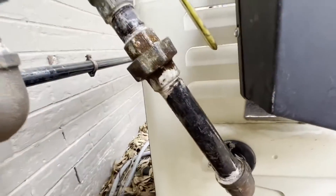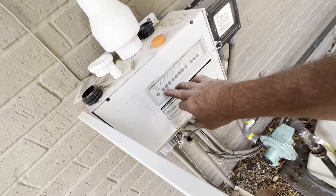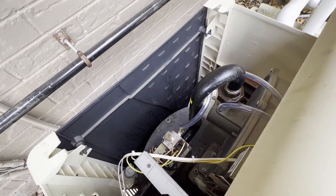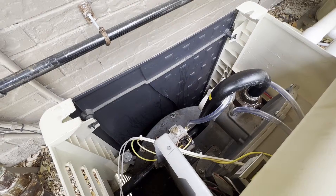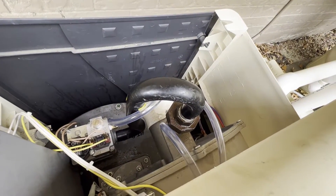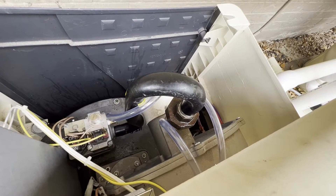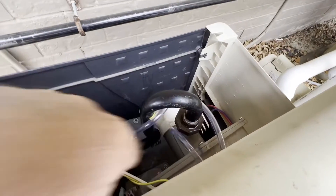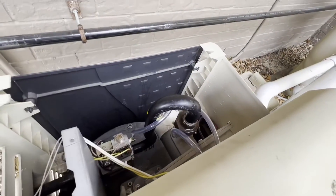Okay, I think we're good on this one. The only thing left to do is to test it — we'll turn it on and make sure she fires up. Got it on, the heater's on. Okay, we're just checking the fan is blowing; we should make sure we ignite. I'm also watching that union right there in front of the camera to make sure we don't have any leaks there, because it's now feeding gas through that pipe. If it's going to leak, it'll show up right now. We're going to heat — we've got no bubbles. We're going to call this one good; just need to put her back together and we'll be out of here. Guys, thanks for watching — if you like it, subscribe.